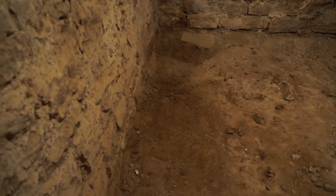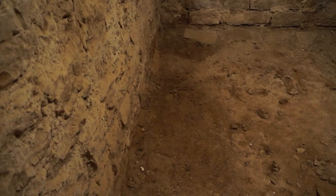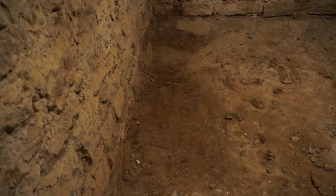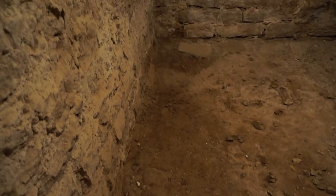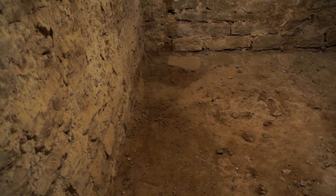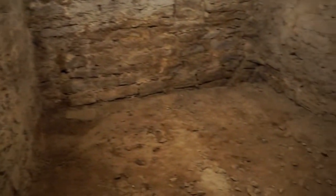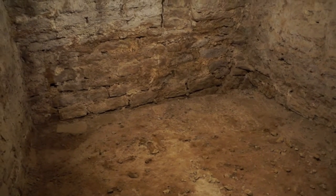It's a little bit damp in spots. The house is built directly onto clay underneath with a very shallow foundation, so if I dig here I'm straight into clay. With the water table and us being built into a hillside, there's always going to be some dampness. I'm not going to put in a damp proof course because that would seal the floor and mean any dampness travels up the wall. We'll keep it all completely breathable so the floor can breathe and we won't get any damp rising up.